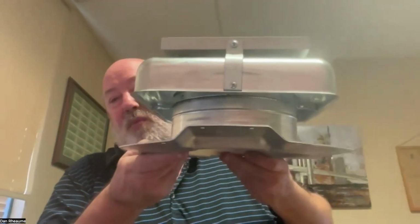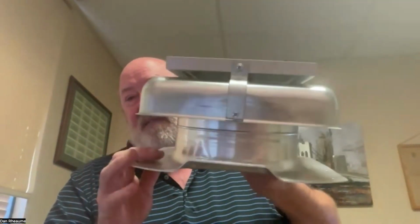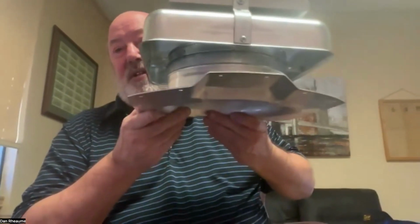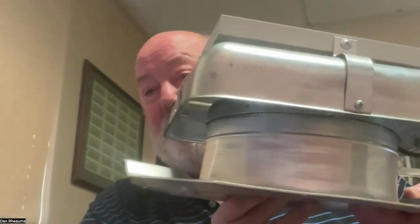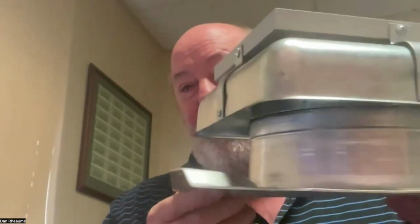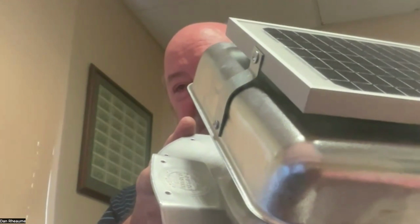They typically have a 3.5-inch strengthening rib or a 6.5-inch strengthening rib. So what we did was we punched our base flashing for a shipping container. Now you have this that just fits flush onto a shipping container, and it's the same construction as the roof blasters. This comes with a gasket because it's sitting on a flat roof. It comes with 16 self-tapping rubber grommeted screws.